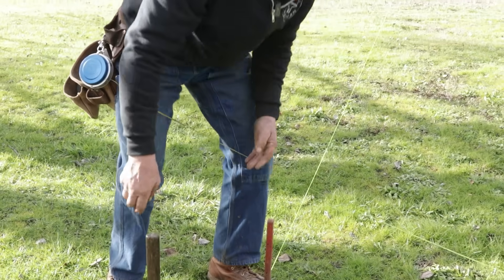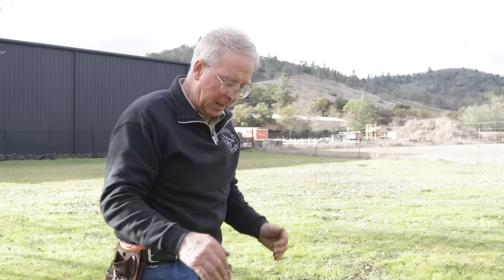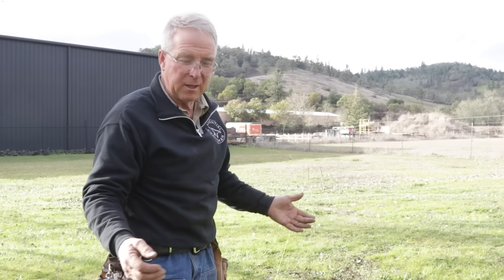Now here's a note: I did not shoot a level grade on this, because this yard is kind of level, and two or three or four or five inches up or down on the ends of a 50-foot line, 36 feet away, is going to make a minimal amount of difference, which can be accommodated as the forms are built. Because what you do when you're laying out a building is you're getting it progressively more and more perfect in dimension. And we're going to get these parallel lines in within probably an eighth of an inch, which is not bad.